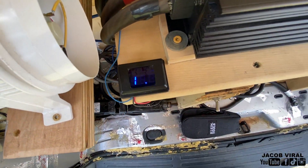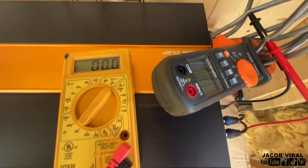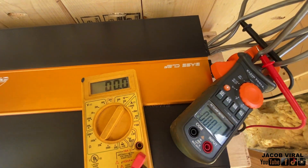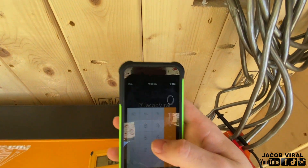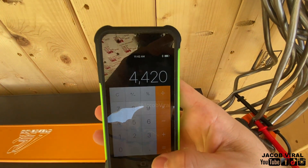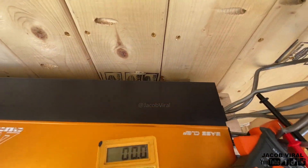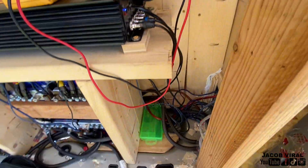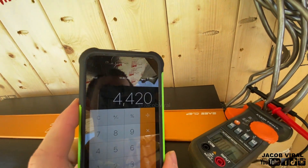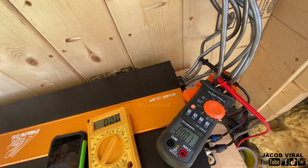There we go — so that dropped. That was probably around clipping. It dropped to 12.8 volts here. We saw 60, 65, and 68 amps I think it was — y'all can look back in the video. So we'll do 68 times 65, which is 4,400 watts. Say it was clamping there, and that was probably under clipping actually. So I'm clamping around 4,400 watts — roughly — with those two numbers.